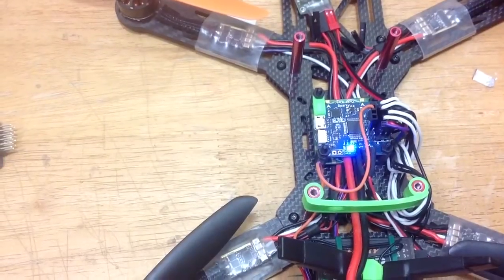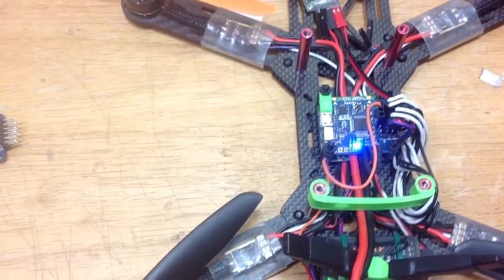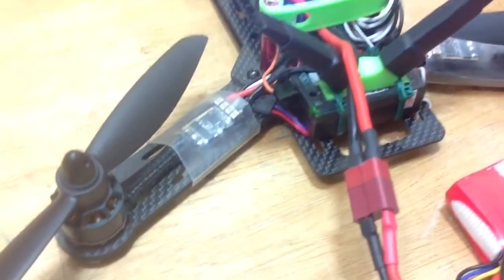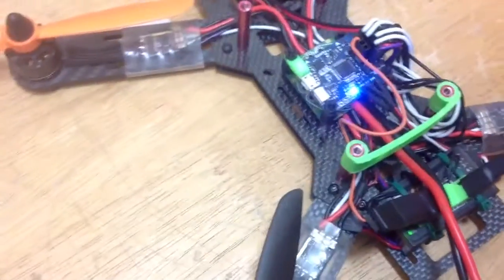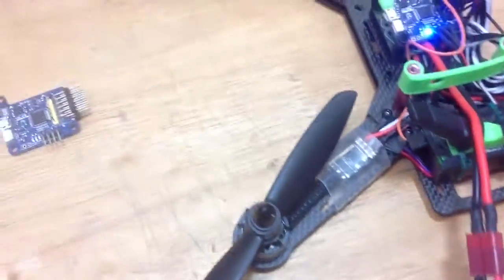These are the more advanced boards that have multiple ports. In this particular board, we've got set up with a smart port. We're using the X8R Taranis receiver. And on the side down here, you see a little servo lead with a little orange cable coming out of it — that's the smart port. They got rid of the flex port and are now using servo connectors, but we only need one wire. That's the receive wire or the signal wire going into the receiver.